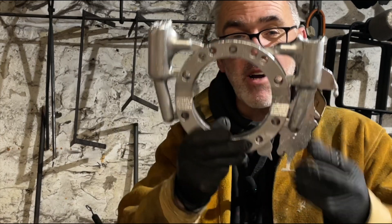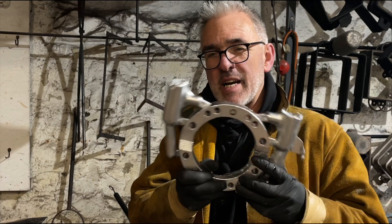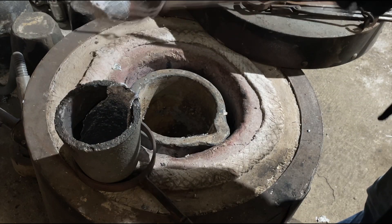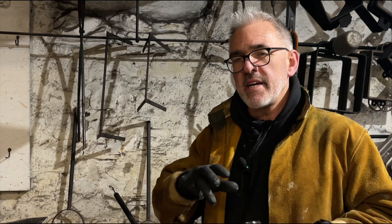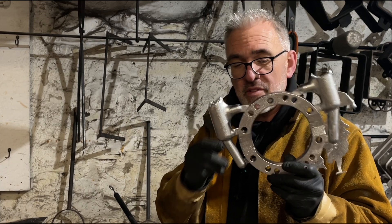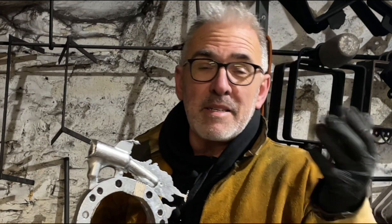We've done pretty well there — we've got ourselves a nice cast. That's what I wanted to achieve. We have a lot of adaptions to the process because we're not lifting the crucible and casting — we're dipping into the crucible, pouring in, decanting and then pouring. There are a few things I want to make to help the process run a little bit smoother, not for this video but for later on. I've got to make a lot more numbers of these and then we're on to the next project. If you've liked what you've seen, please give us a thumbs up, or even better still, subscribe.